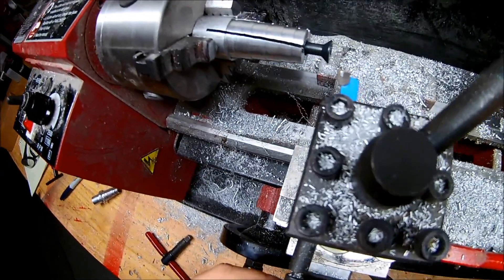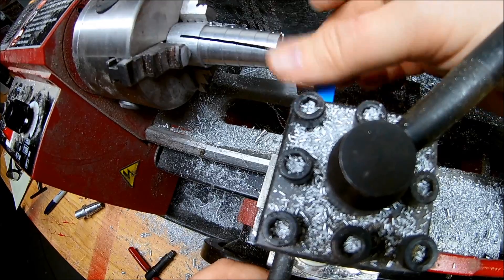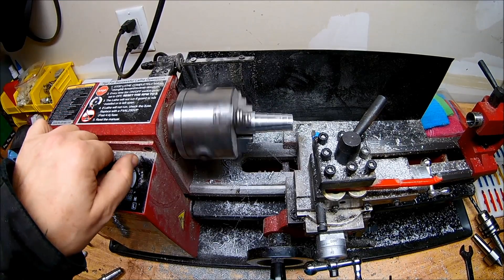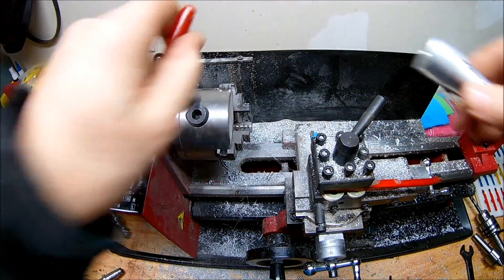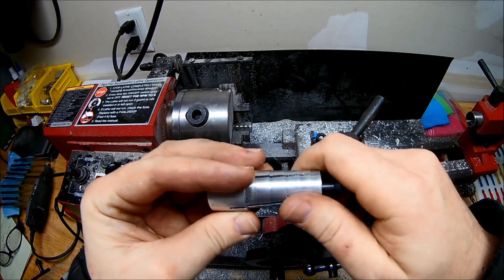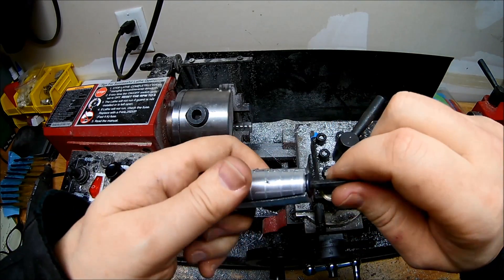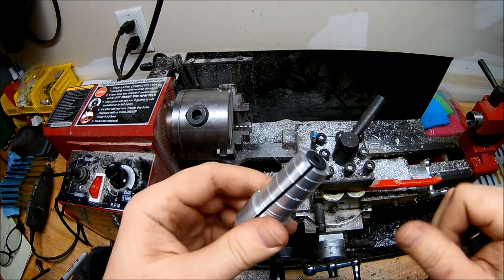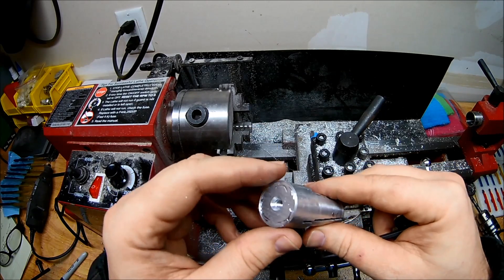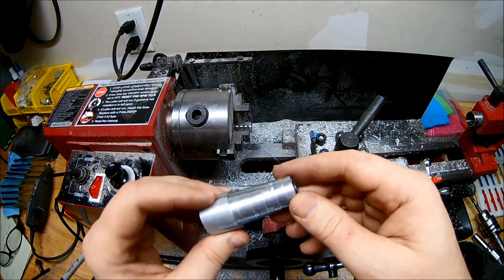We've tapped the hole in here, our bolt will go in, and that's working just fine. However, it is flat on here and there's no place for this to go in and make it a little more flush. I don't have any tools small enough to put a taper on it, so I'm just going to use a diamond file. Now I've got a little bit of a taper on the inside for the bolt to fit into. She expands, and it fits fairly nice. You don't have to do that if you don't want to — it just makes it look a little bit nicer. You've got to love having a tool that can make other tools. Thanks for watching — hope this was helpful, and good luck making your own.